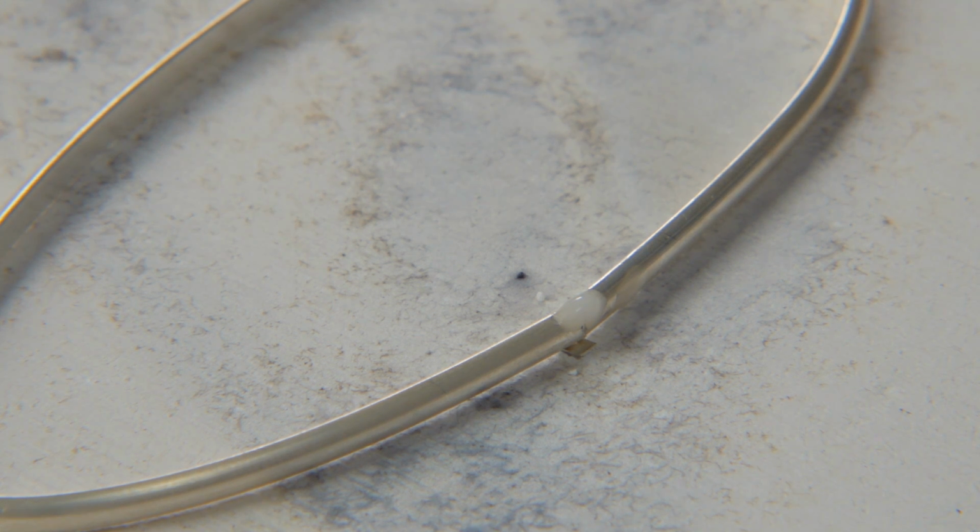One of the main downsides actually to heating up the whole piece is oxidation. I'm sure many of you have noticed that the longer and the slower you heat the piece, the more it oxidizes. At a certain stage of oxidation, no matter how much heat you apply, the solder's never going to flow. So what I do is I just get my seam hot and fast. Hot and fast are the two most important words to remember. If you do that when you solder, everything is going to suddenly become a lot easier and a lot happier.